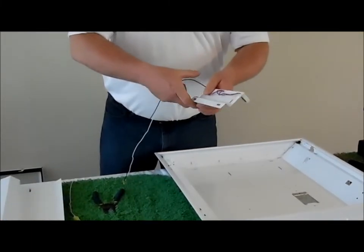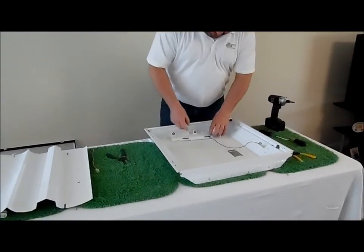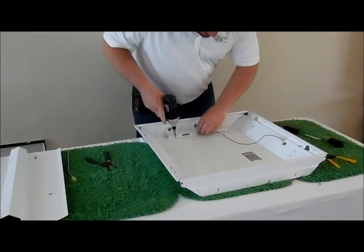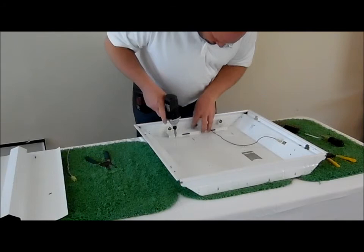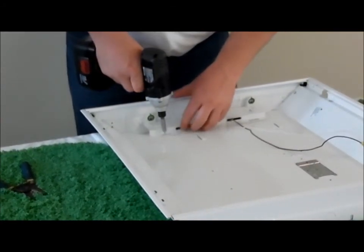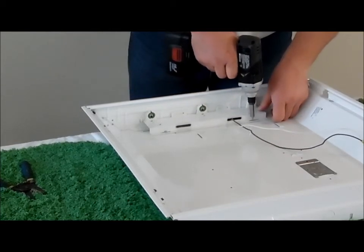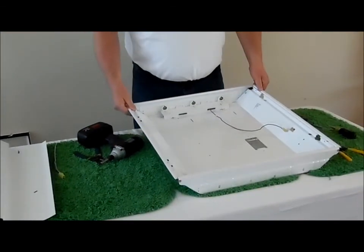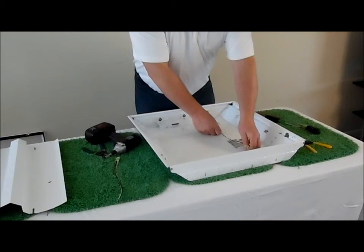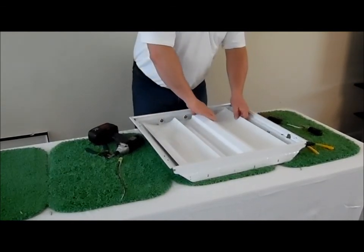We are ready to retrofit. Now that this is wired, place it in the fixture and make sure it aligns with the tombstones on the other side. Use your self-tapping screws to attach it. Come to the other end, connect your power — this leads out of the fixture. Bring in your retrofit cover and insert it into the existing slides on your three lamp retrofit.